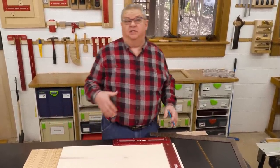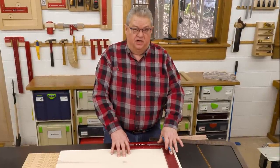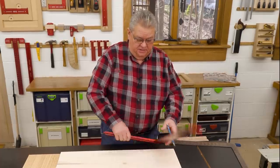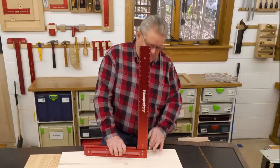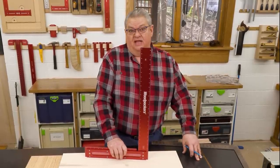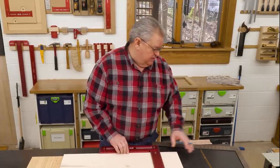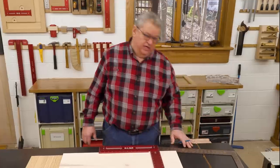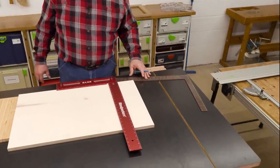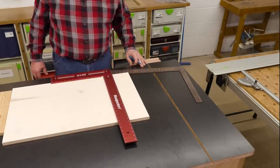The other thing is simply the precision. This is made to a tolerance of .0085 degrees — that is one thousandth of an inch variation per foot along that edge. Very, very accurate. My old framing square has been following me around for probably 30 years. It's pretty close, good enough for carpentry work for sure, but it is not within three thousandths of an inch.